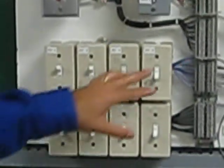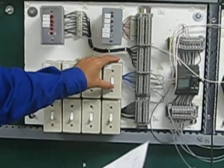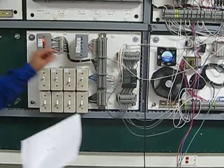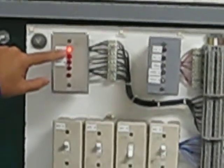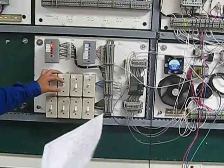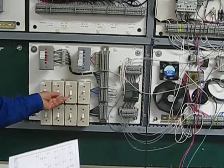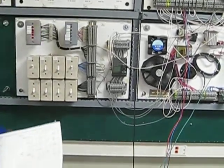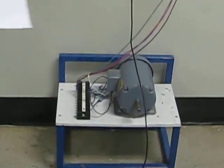The last thing is to put the system in auto. We programmed switch number four for auto mode. I'm going to turn switch number four on — switch number four should immediately, based on the program, turn pump number one on. Pump number one is on, and at the same time a neon light turns on right here to indicate that the system is in auto. When we reach the right pressure and turn off the pressure switch, pump number one turns off.